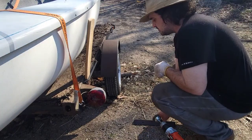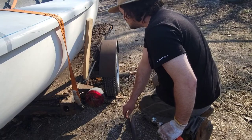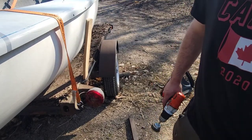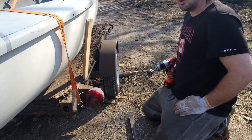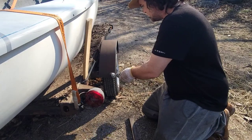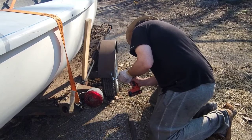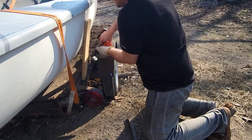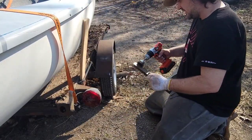I've decided I'm going to put my license plate out here. That should be just fine because it's a fairly narrow trailer and it's not sticking out about two inches. Any professional welders out there — I may not be a professional, but this is going to work for what I'm doing. I'm just using an arc welder, that's what I've got. For all you new welders out there, just make sure when you're doing your welding, you want to clean up your spot where you're going to clamp your ground.